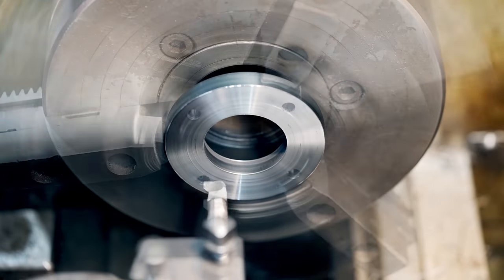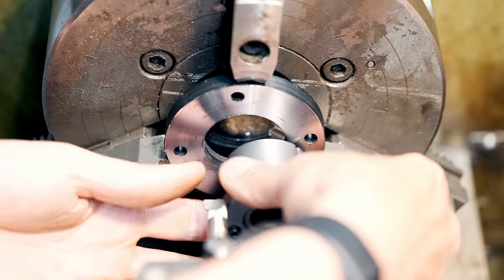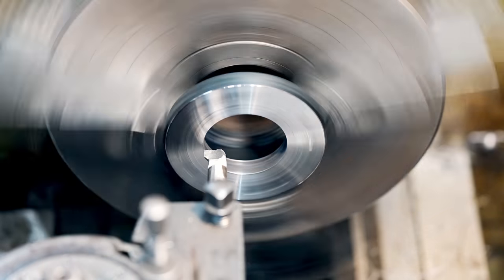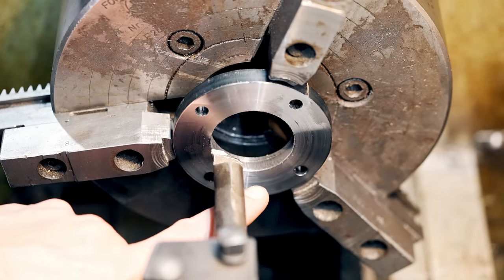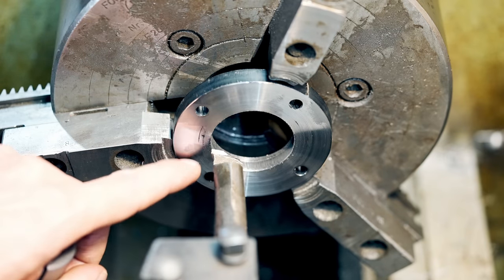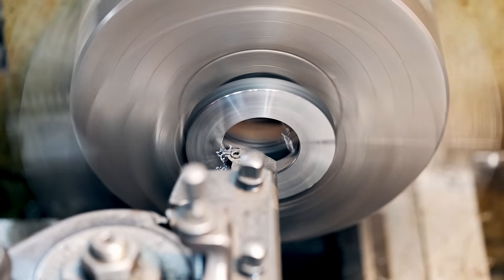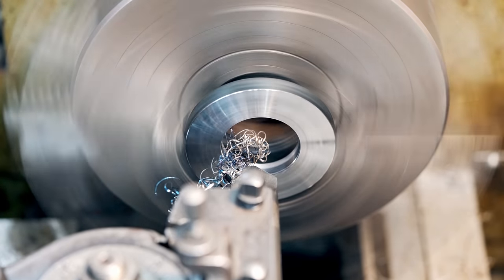This was perfect — we can even see some residue from the laser cutting. It was a very small cut. I don't think we can get the bushing in now, which is perfect, so we can take some more. We're running into some issues with the work-hardened laser cut. With the tooling we've tried, it's rubbing — it's not cutting. So now we're going to try a carbide insert and see if that does it better.